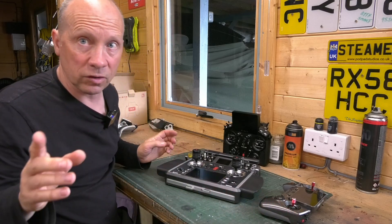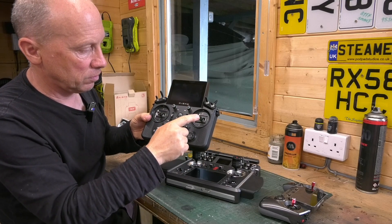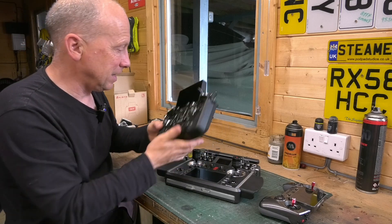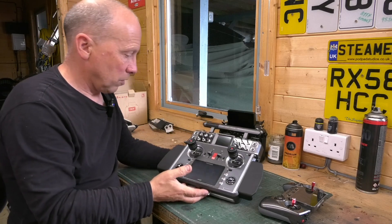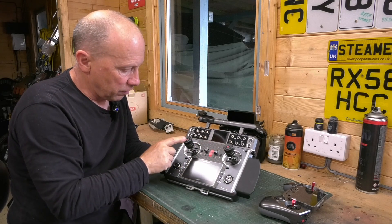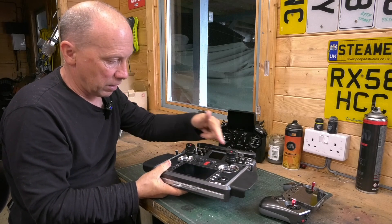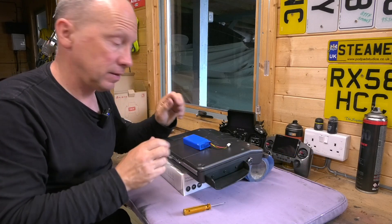One of the things I was asked quite a lot is how I changed my stick configuration. What I mean by that is, if you look at the X20 here, this position bounces backwards and forwards and that bounces backwards and forwards, but the throttle position stays in a particular position. I didn't need that — when driving the tanks, the bigger one-sixth scale and one-quarter scale tanks, I needed a slightly different configuration. So this control is sprung-loaded up and down, and also sprung-loaded left and right — exactly the same as that one. Here's how you change the stick position on the Tandem XE.